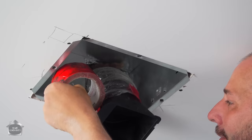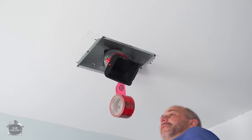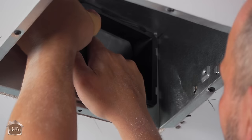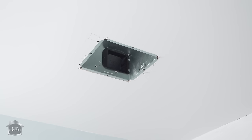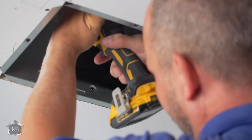There are a lot of different ways to connect plastic to plastic — you could use a gear clamp or even duct tape — but for my money, plastic to plastic, that's tuck tape right there. Once that bonds together it's never coming off, and that cost me three cents and fifteen seconds. We stick it back in — there are little tabs on the side that have to be positioned just right, so you stick it in at an angle to get the tabs in, then it closes like a door. That's where one of our set screws goes — most likely Phillips. I would give somebody a lot of money if they would stop using Phillips screws.